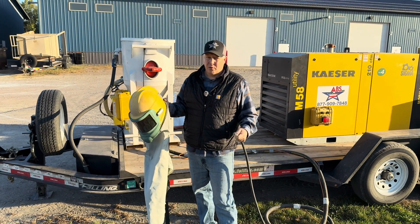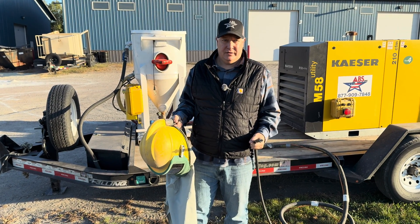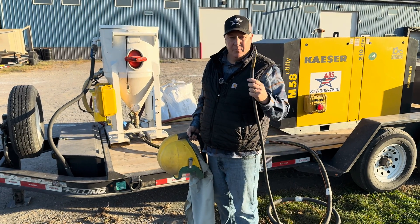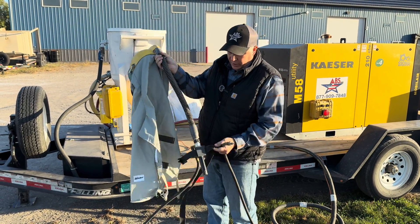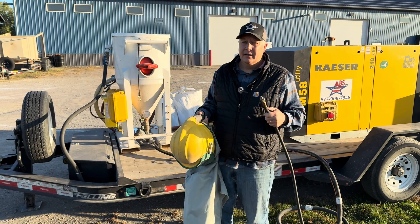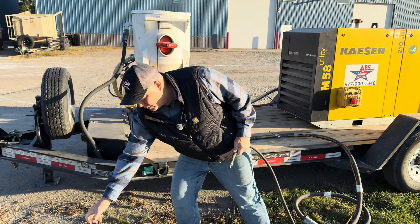I have my safety gear here — it's important. I don't want to be spitting rocks and anything else later in the day. One important rule: hose to nose. From the hose that you hook up to your breathing system — that can be any brand, I like Bullard, they're very easy to fix and work on in the field — but from the hose you hook up to your nose should be all one brand. We have Bullard breathing hose, a Bullard air conditioner, a Bullard breathing tube. It all needs to be the same brand to be compliant. Despite the fact that Nova, Bullard, and Clemco are all certified, technically when you put them together it is not a certified assembly. Pick a brand and stick with it — hose to nose.